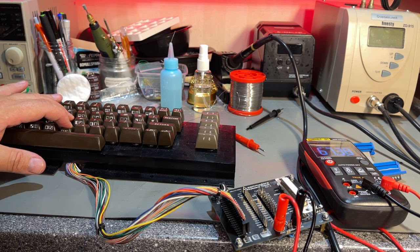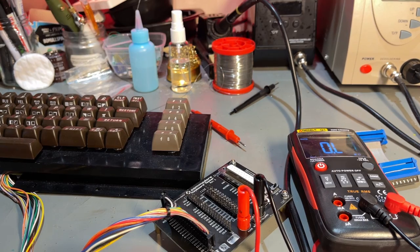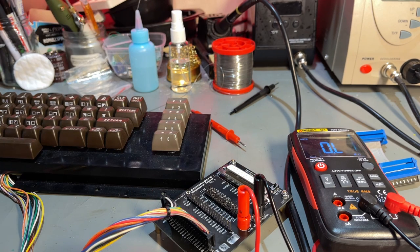I think I need to read the documentation one more time. Probably something I missed. Okay, I figured it out. I had the range for 2 digits only, and when I press 1 key, it goes just over 100 ohms, so it didn't register that at all as a measurement. However, when you press 2, then the resistance goes down, obviously, and 3 even more, and 4. Because when you have several resistors in parallel, then the total resistance will be lower, obviously. So this works just fine.